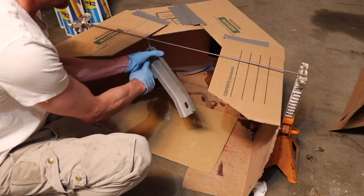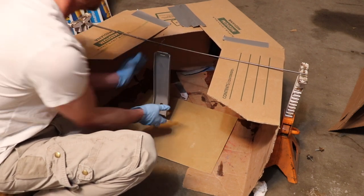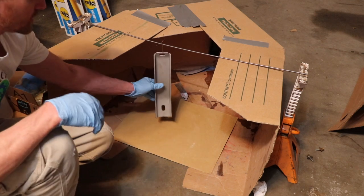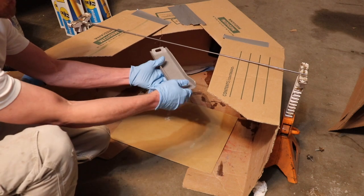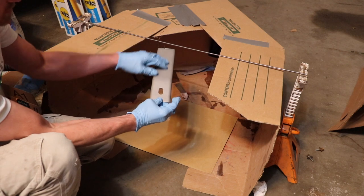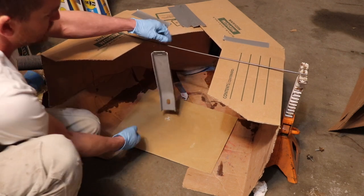Because these are tight angles, you'll get a Faraday cage effect. So you want to think about how you're going to hang the part and the way the powder is going to lay on it. If anything is going to be flat, you're going to have buildup in the trough. If you lay it the wrong way, you'll have buildup and it'll be too thick. Think carefully about the way you're hanging your parts.